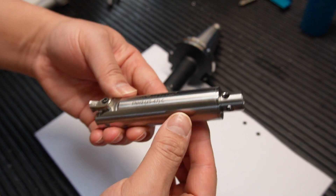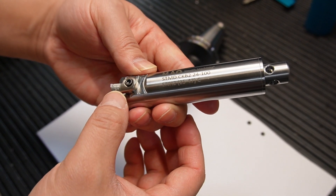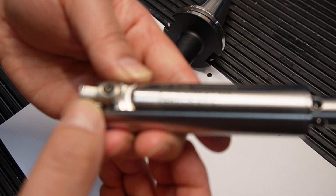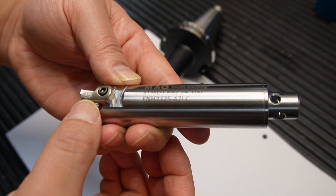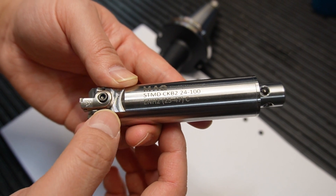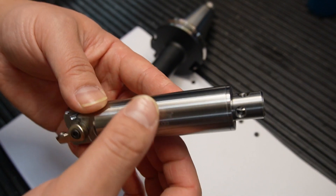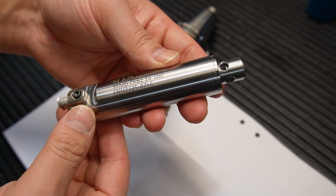When you get such a tool, the first step is to check which type of insert holder you have. It's a little bit difficult to see here, but I'm going to put a bigger picture later on so you can see clearly. It's an ENH2-1, so it's the first type. Pay attention to our catalog — there you can find which size of hole it can create when you put it on the body of the CKB2 product.